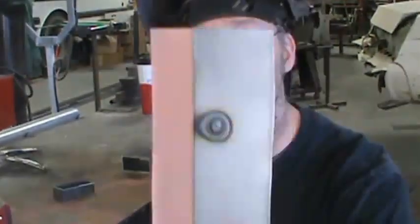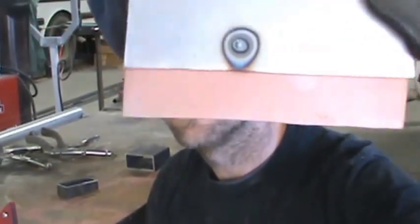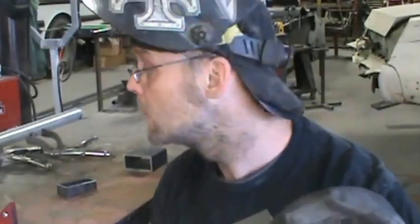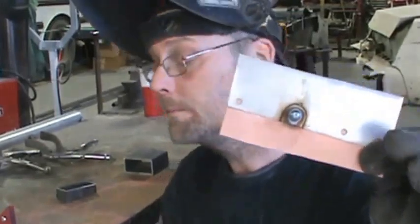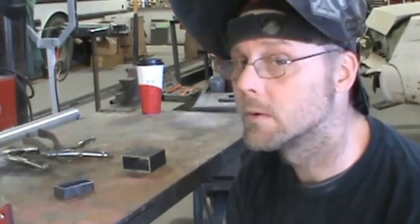The other primer I had used wouldn't have worked out so well. You can see there's not a lot of spatter, not a lot of debris left over from welding. I set it a little hot and you can see how immune to heat that weld-through primer is. I'm going to zap the other plug welds to keep everything together, then flip it over on a couple blocks of metal to get it up off the table — because the table acts as a heat sink affecting your weld negatively. We'll get the other spot welds done, then look at stitch welding on that weld-through primer.